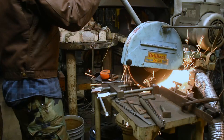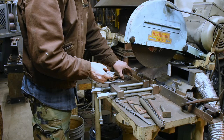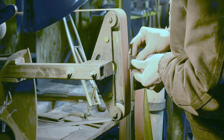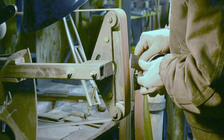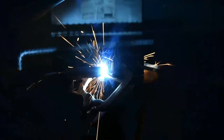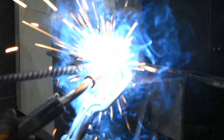I've set a stop on the chop saw so all these pieces come to the same length. It doesn't have to be that big of a billet. Got to deburr, get everything cleaned up. Of course, got to weld the ends up — busting out the old 300 amp MIG Airco, running a nice fat bead down each corner. Then you've got to get a good weld on your handle or your handle will fall off, which you'll know if you've ever done this kind of work.